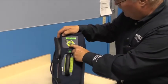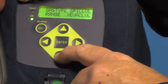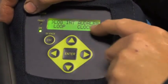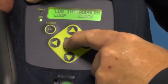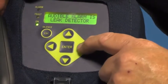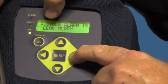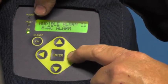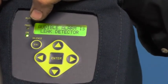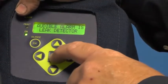The rest of the menu deals with different areas if you were going to use it as a stationary leak detector. What we want to make sure of is that in the menu under audible alarm, the audible alarm is set to leak detector. If it says anything else — off, anti-alarm, system fault, leak alarm, spill alarm, evac, monitoring stopped — it should always be leak detector. If anyone has changed that, it's not going to act right and you're going to think you have problems. So always make sure the audible alarm is set to leak detector.